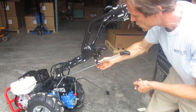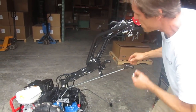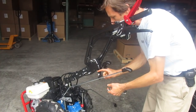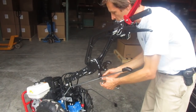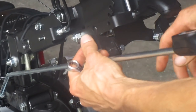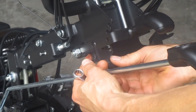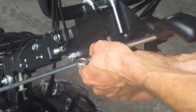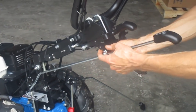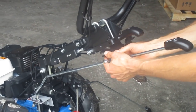These things are about $7 a piece, so you don't want to replace them any more often than you have to. What BCS did about two years ago is they put a little tab on the mounting bracket so that when they mount these things at the factory, this tab locks into the back end of the plastic piece and keeps you from twisting it. It now has to mount 90 degrees to the shift rod itself, so when these things wear out a little bit, you've just got to replace them — which is highly irritating.